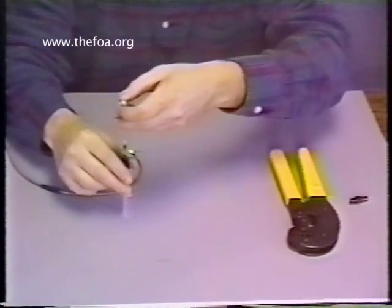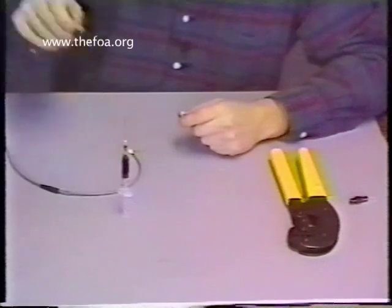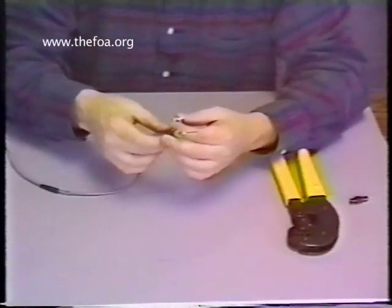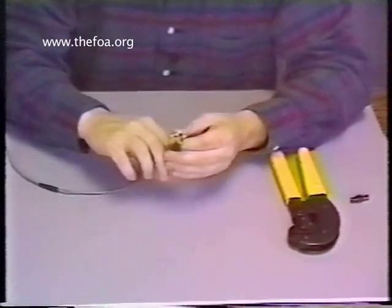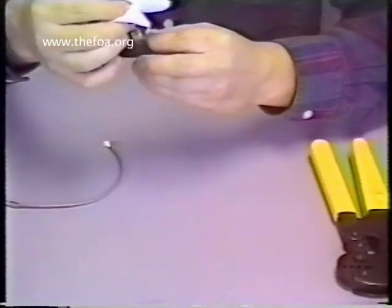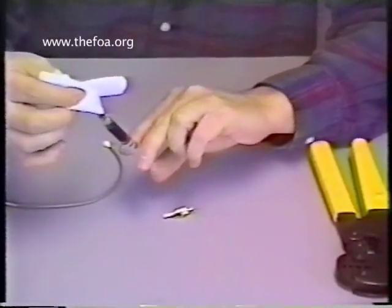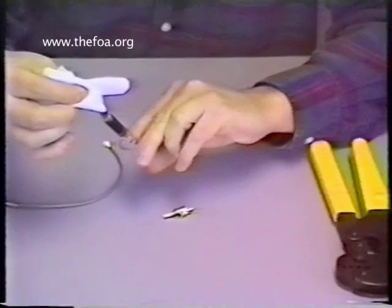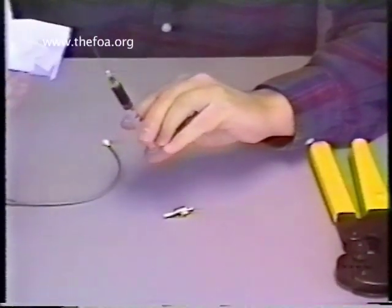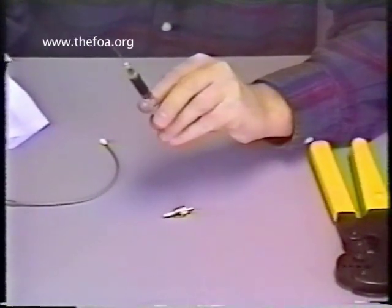In the meantime while I'm waiting, I had this protective cover so that I don't poke myself with it. We'll take that and get rid of that now. Take the syringe, cover it with a Kim Wipe, and blow the air bubble from within. There it goes. The reason we cover it with a Kim Wipe is because any little bits of adhesive will spit out of the needle that's sitting inside there.